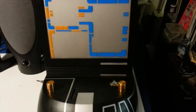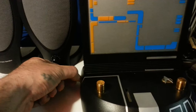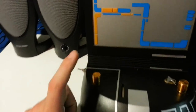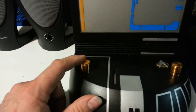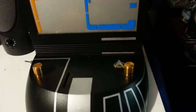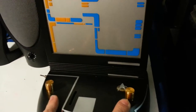What I did is I added an up and down for the pitch. Middle is normal, so it's bypassed. Down is low, of course. And up is a high pitch. This is an extra high pitch potentiometer to actually limit the highs, because the highs are way too extreme and cause a loop and crash. This is the main pitch, which is low and highs, so that's in conjunction with this one.